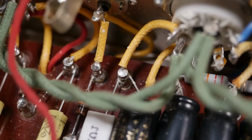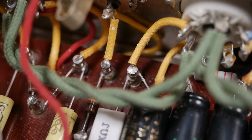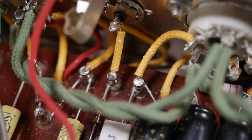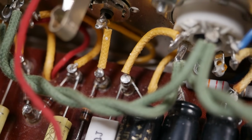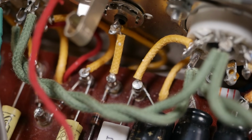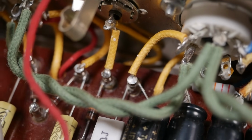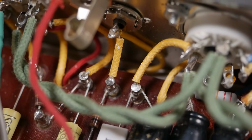Now we'll get into the circuit and everything momentarily, but just one quick thing on the turrets. To me, the idea behind a turret is you connect your wires, you wrap your wires around the actual turret, and then you pop your component leads through the top. And the idea behind that is all your infrastructure for your circuit's set up and the wiring's wrapped around the turret, and then if a component fails, you can just desolder it, pop it out of the top, pop a new component in there for serviceability.